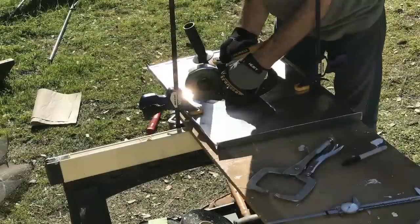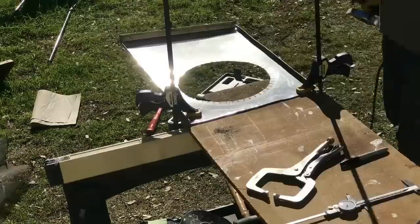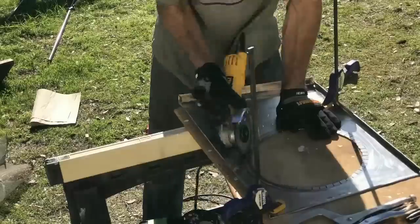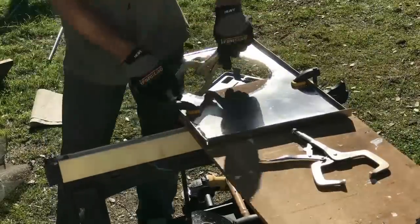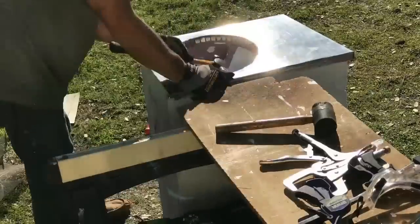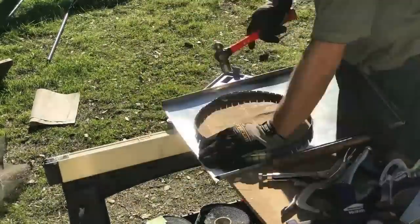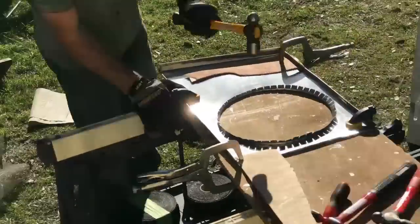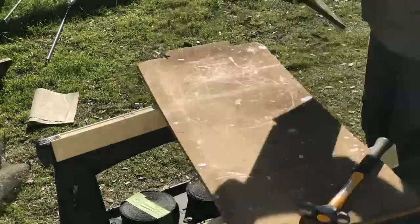Once I cut the piece out and fold over all the sharp edges, I need to cut out the hole for the sink, then notch that hole all the way around so I can bend those pieces. I score a circle all the way around the hole so the steel knows where to bend. Then I take my clamp, bend it around all the way slowly moving it up, place it on the cabinet, and start using my hammer to bend that into the shape I want — moving slow, bending slowly, not forcing it, then flattening it all the way around.